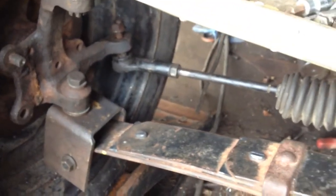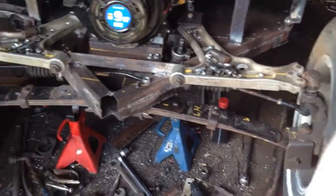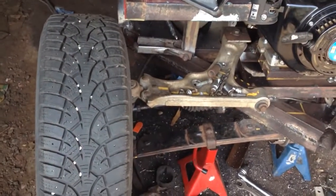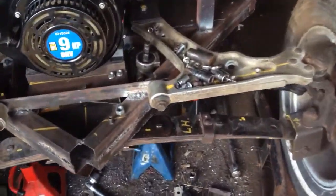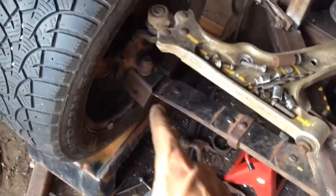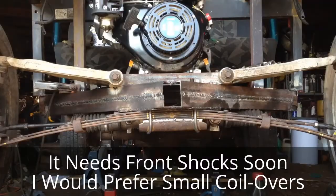And over on the passenger side, I've already got that done. It seems to me that that's enough to get the alignment good enough. So both wheels are fairly straight to the eyeball, and I can do a better alignment later after I've put the lock nuts on the kingpins, because I think this one here is a little bit loose. And I need to put the nuts on the ends here.